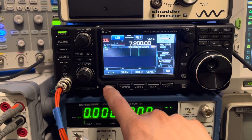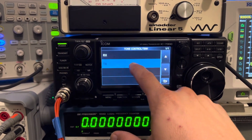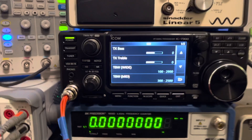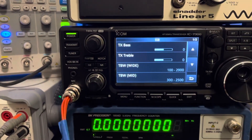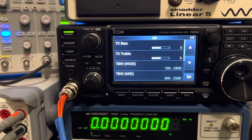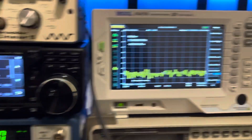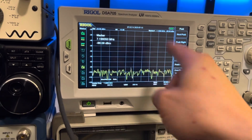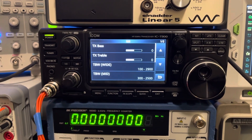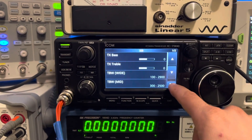I've also messed around with bass and treble settings. Bass makes no difference — if I drop the bass down as low as I can get, to minus five, it doesn't make any difference on third order IMD at all. Treble, if I drop it down to minus five, will just change the IMD from one side of the sideband to the other — it doesn't really decrease it, it just changes where it's being emitted. So those aren't really any help for third order IMD.